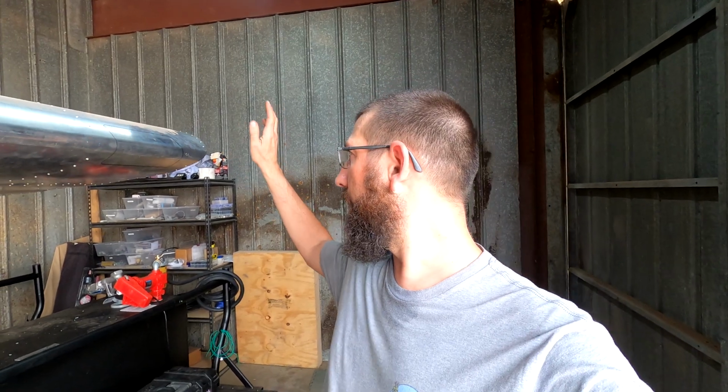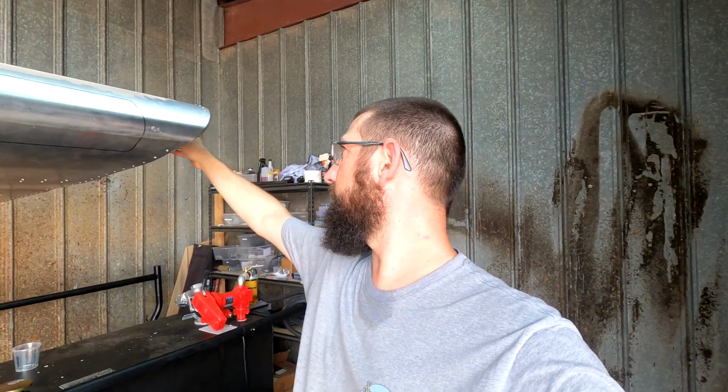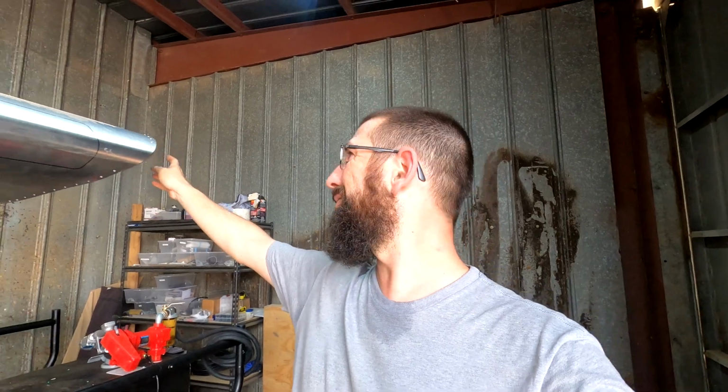All right, guys, welcome back, and we're going to end the video here today. We got a lot of work done today, guys. Really did. I'm really happy with the progress that I made. The left and right wingtips are now mounted. As I showed in the video, we used riv nuts to attach the lights to the wingtips. That way when I'm ready to paint, I can still take the lights off, paint the whole wing with the wingtip on so it all matches, and then that will be perfect.